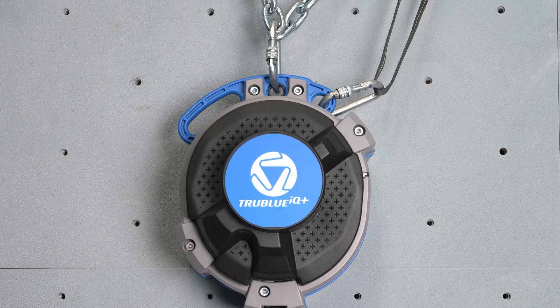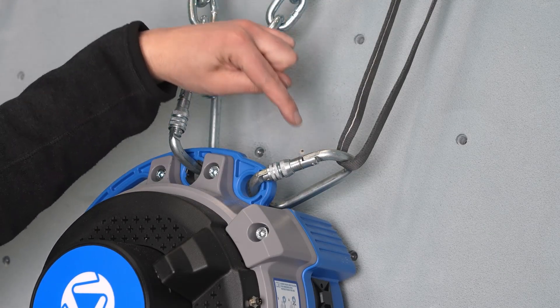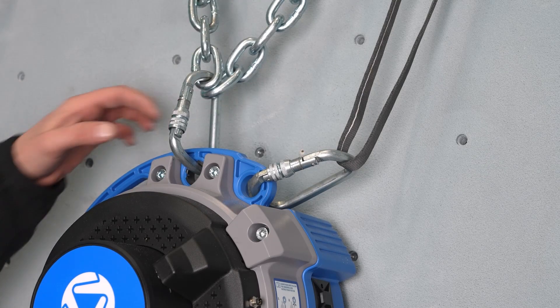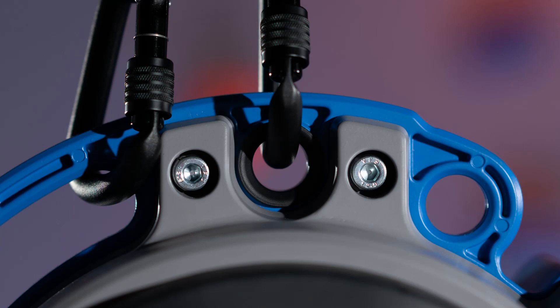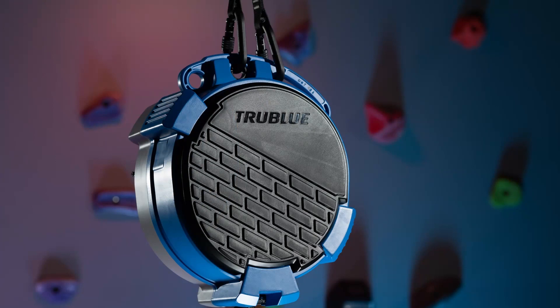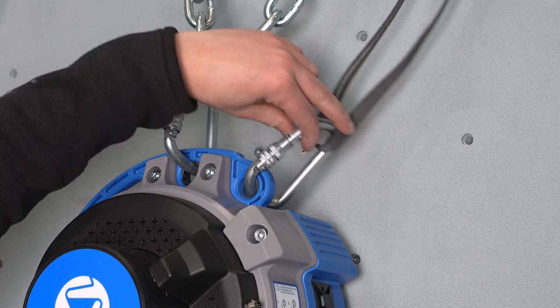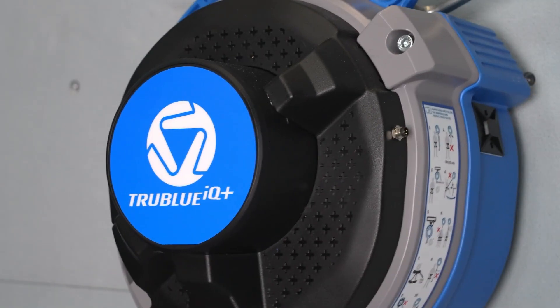Like all True Blues, the IQ Plus has a two-point mounting system for safety and redundancy. You have your primary mounting point in the middle and your secondary mounting point on the side. One of the new features on the IQ Series is this plastic mounting insert, which protects the aluminum housing from long-term deformations to the mounting hole. You can order these inserts on the Headrush website — it's a lot cheaper to replace than an entire Auto Belay. Start by positioning the device with the logo facing outward so that the back guard is taking the brunt of any contact with the wall. You're going to want to hang the device so that the primary mounting point is weighted, while the secondary mounting point has a little bit of slack in the line. This allows the Auto Belay to swing. As the climber moves from side to side, that swinging motion reduces wear on the webbing and on the nozzle.